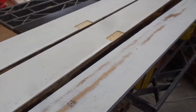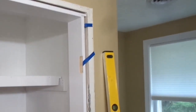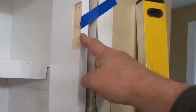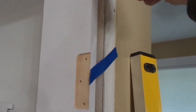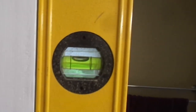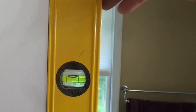Here are the three pieces for the door frame, each with two coats of primer. They'll be a lot easier to paint now than after installation. By far the most critical thing when hanging a door is that the hinges have to be perfectly plumb. So I have to get this piece of the door frame, which holds the hinges, plumb. The wall leans out a little more at the top than at the bottom, and I have a threshold to contend with — I want the frame to line up more or less with the threshold.